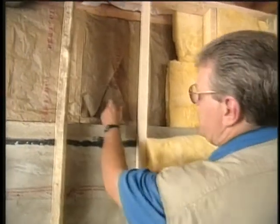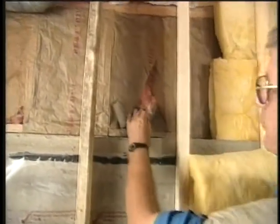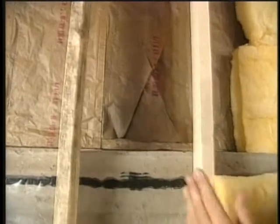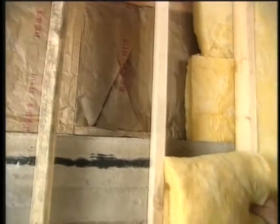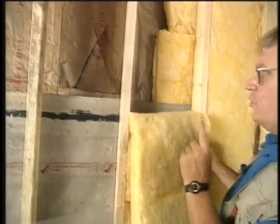As you can see, the old insulation that was there already — we have sliced the vapor seal, because that way when the vapor seal comes back up over top of the finished inside wall we don't want to have two vapor barriers. Only one.